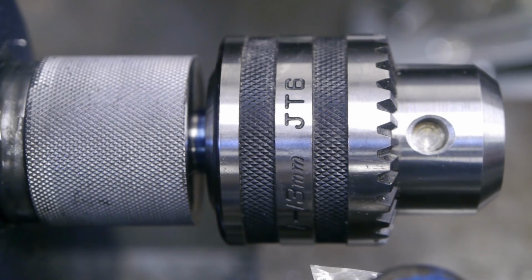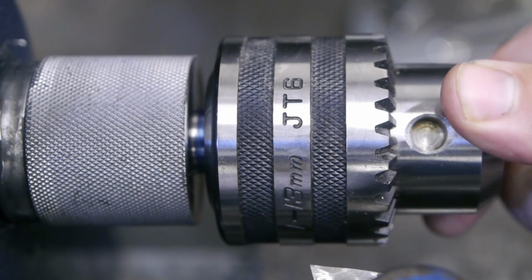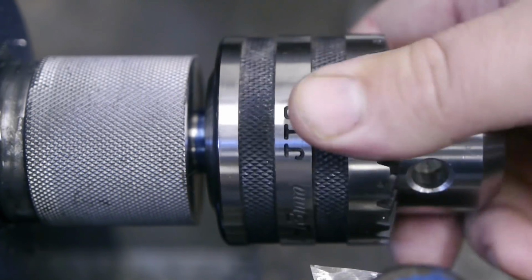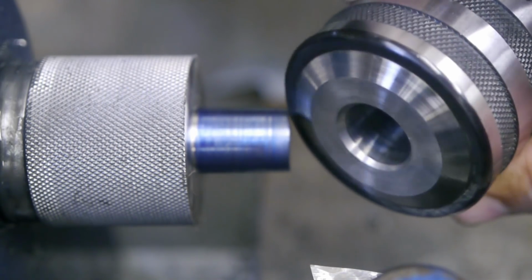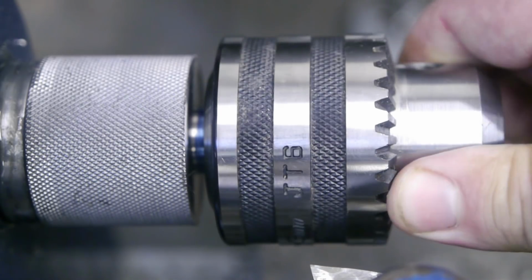After I took a second cut, there was still play in the front of the taper. So I took another hair-like cut, and now it feels like there's play on both sides of the taper. And, well, sure enough, after a bit of finger painting, a high spot was revealed inside the drill chuck taper. It's probably hard to see on camera. Well, perhaps I can take out the high spot, but unfortunately and unknowingly I already took off too much material off the taper, so this thing is never going to fit.